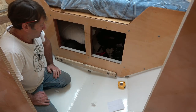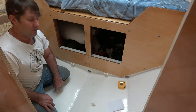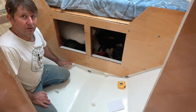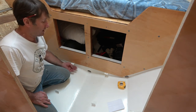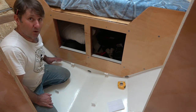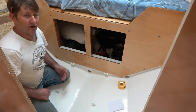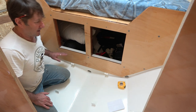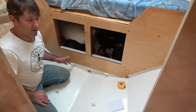Just to explain what I'm up to here. As you can see I have two cleats here and there are two cleats on the hull floor also, and they are for mounting the cabin sole in this v-berth floor space here. What I'm going to do is bolt some angle which has been hot dip galvanized underneath those two cleats and one on top of these two cleats here. What I'll be doing with all of the cabin sole is putting a little strip of rubber glued to whatever the cabin sole will rest on, so that I don't get that knocking noise where it's ply board against whatever it's sitting on, and so that it just absorbs a bit of the sound when you're walking through the boat.